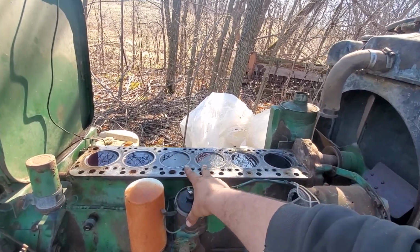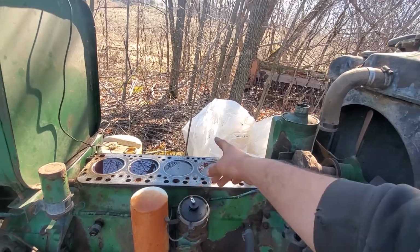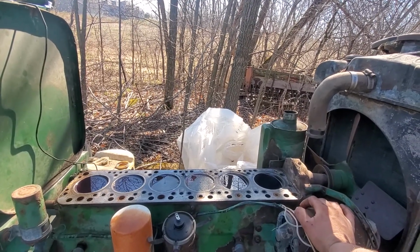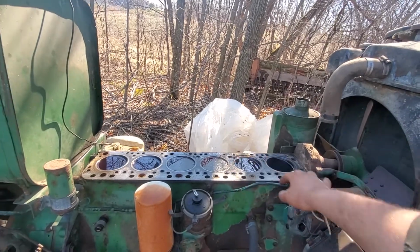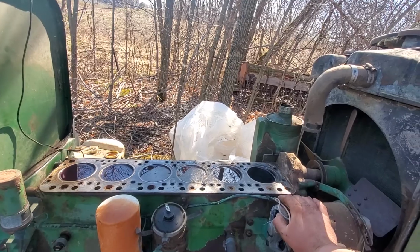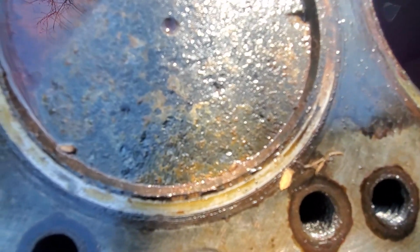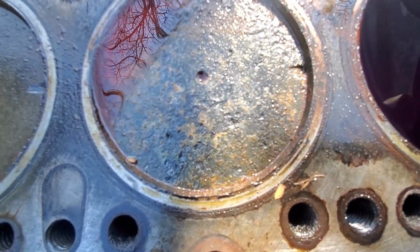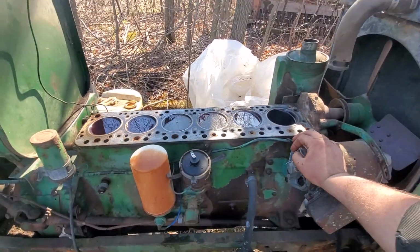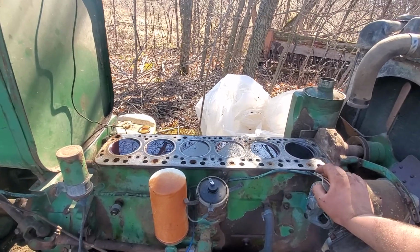But these two, this one had like a mountain of tree crap in it because the pipe broke off at the manifold, and it's just been getting rainwater and tree crap ever since. It had a big mound of loose tree crap on it. Nothing was packed, nothing was solid. But you look around the piston ring gap, and now there isn't really one. So, oh well. I tried hammering on it with a board. The motor will not turn over at this point.